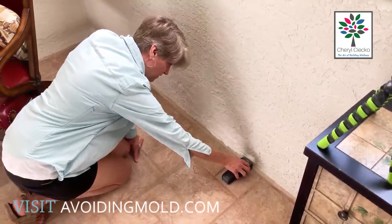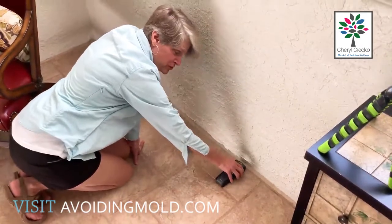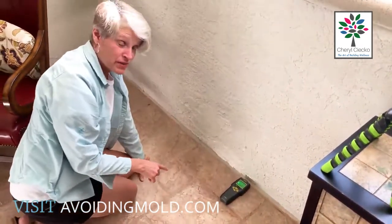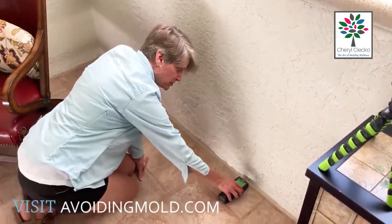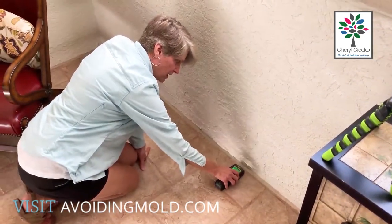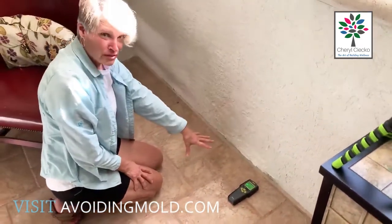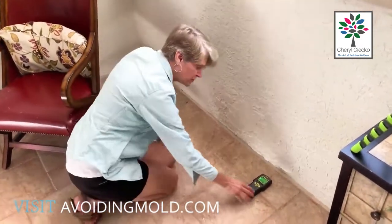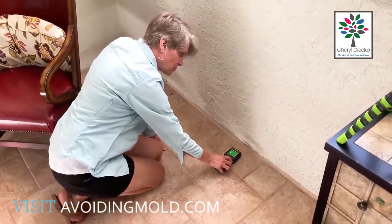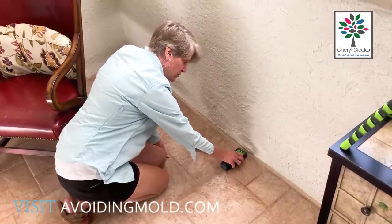66, 65, 64, 68, 74 percent — and it's beeping, which for the masonry setting means that's on that scale. So this is a lot of water right here. It has not rained recently. They did have a hurricane — it's Florida, actually. But you can see this is reading in the 40s: 48, 47.